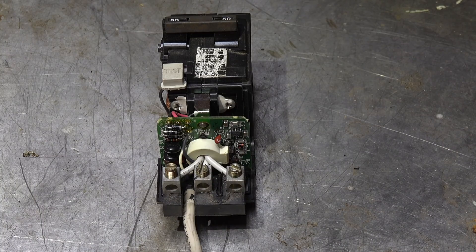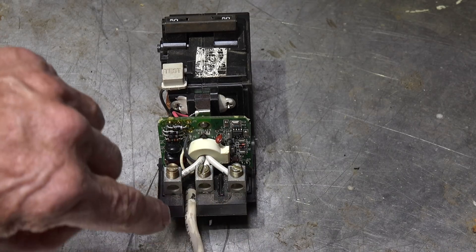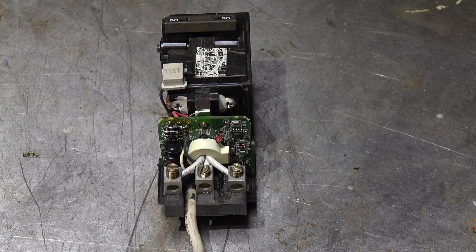What they do is run the neutral back through the inductor and out this wire to the neutral lugs — that balances the circuit again. It cancels out that 1 amp going through the controls, because by going through the inductor it just cancels it out. I didn't explain that before, so I just wanted to put that in for a better understanding of how these things work.